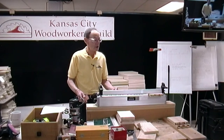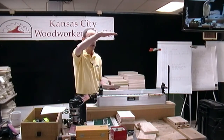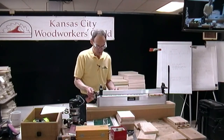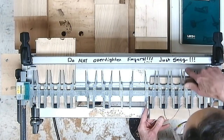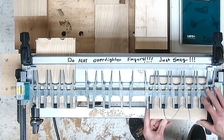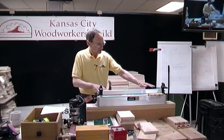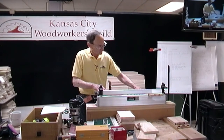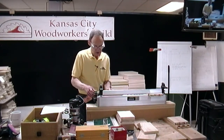See how I'm trying to fit it in from the front? It won't go in. And that's going to tell you, if I tighten that down right now, my finger assembly's taking a nosedive off here to the right, so that's why I'm putting this back in. And by the way, there's a little knurled surface for clamping back here, and it's about a 32nd higher than the base that the board you're going to cut is sitting on. So don't push it past.